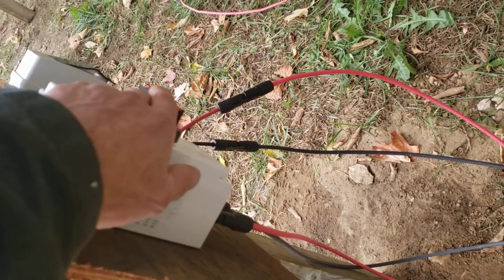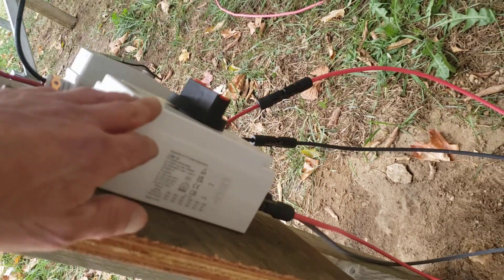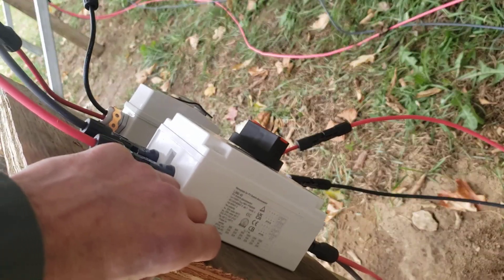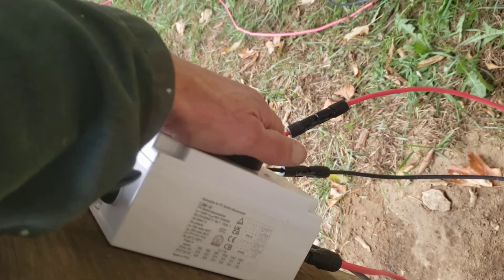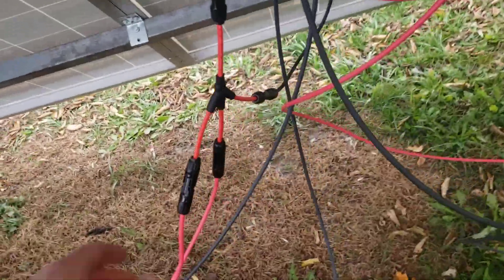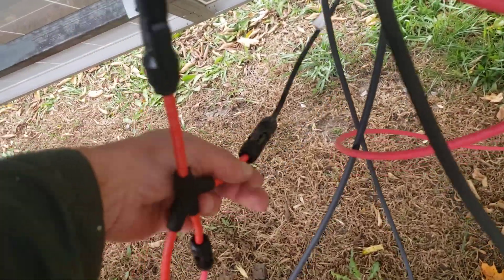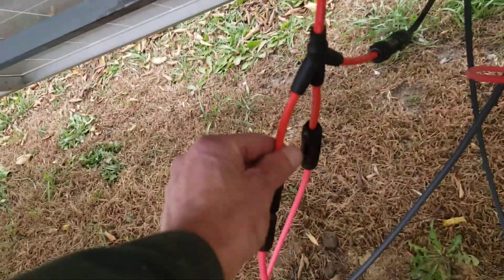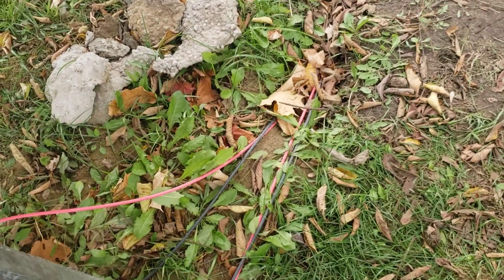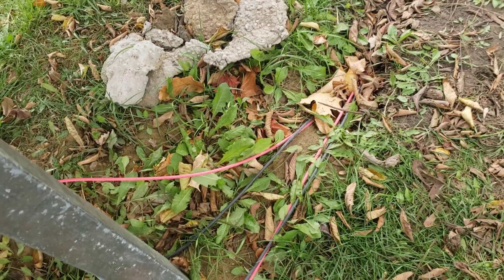So I have the option to turn on both heat pumps. Obviously I'm not an electrician, and this is totally off-grid — you can't do this sort of thing if you're grid-connected. But on a crappy day I can turn off both heat pumps, turn on 16 panels, and feed that through this triple feed. I have four panels in one series, eight panels, and eight panels all running into one line that feeds down into the shop to charge batteries in low light.